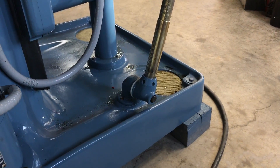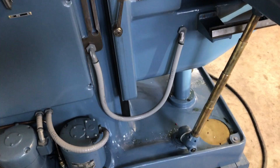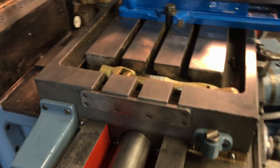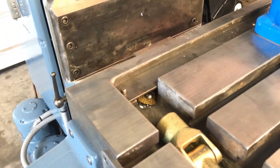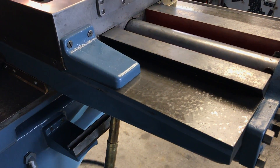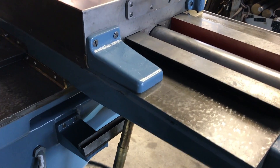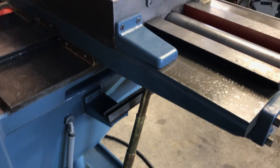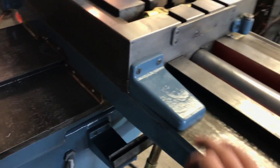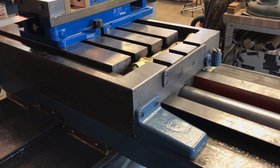For the cutting fluid, there's a drain tube that goes from the table down into the base. The base of the machine is actually the cavity for the oil — it'll hold just about six gallons. It drains in the back of the table, and there are two tubes that drop down into the X-axis table support and drain down into there. These covers here actually cover up that slot in the table when you have it moved to either the extreme right or extreme left.